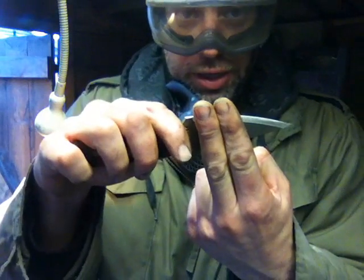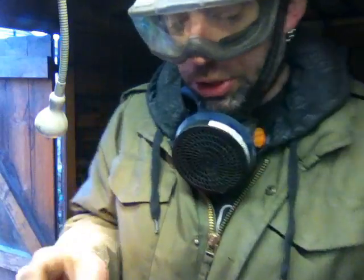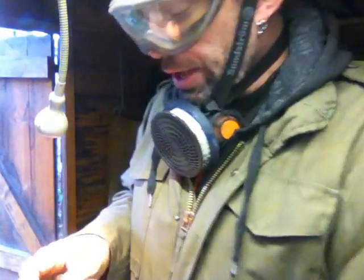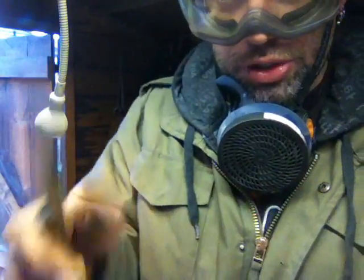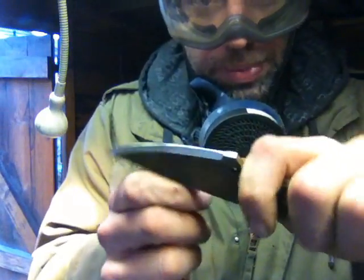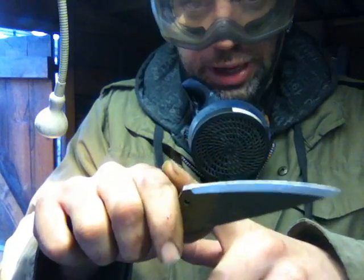I'm going to cut it in with the edge of the belt, and then bring it back again. One other thing I'm going to do, and I found this helps, is I'm going to start with my weak hand. My left hand is my strong hand when I'm grinding, so I'm going to start with my weak hand. Reason being is because if I get a perfect grind going on my strong hand, then I have to chase it up with my weak hand.